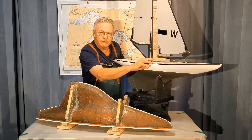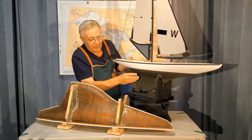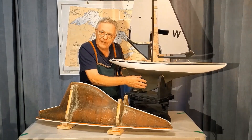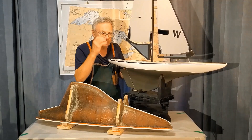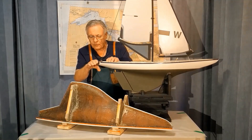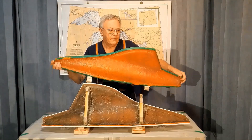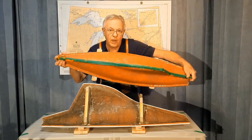I thought that if I raised the shear line by one quarter of an inch I could raise the waterline slightly and then increase my interior lead ballast from 4.2 pounds to 5 pounds. I also wanted to put more reverse rake on the transom, as I thought it might improve the overall appearance. This is a new six meter hull mold on top of a new plug.